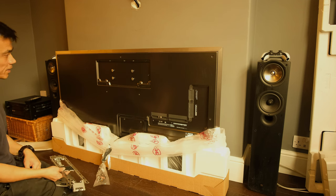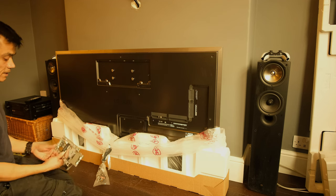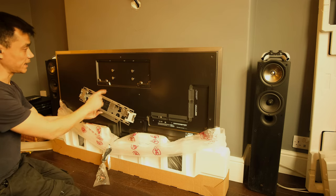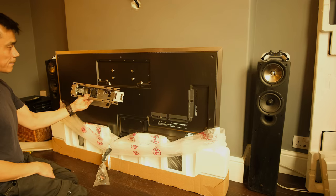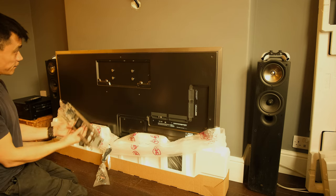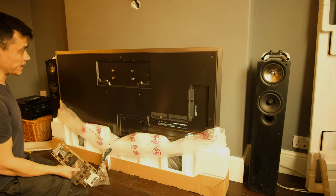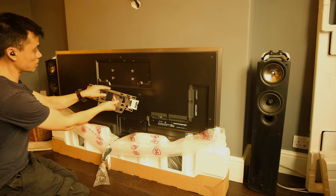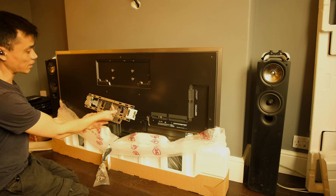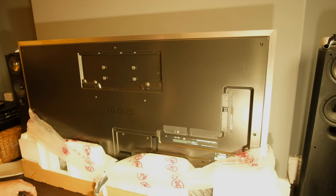There is a full video guide on LG.com of how to do it with a paper template and so on. I'm not doing it that way — it doesn't suit me. You'd put stickers on here, stickers on there, line it up with a huge paper template that goes up to an 83 on the wall. For me, if I know where I want the top or bottom of my TV, I can simply attach the bracket to the TV, measure from the top of the bracket to the top of my TV or bottom of the TV, and mark out the bracket that way.